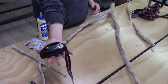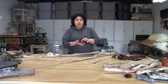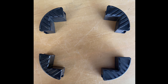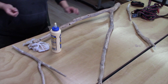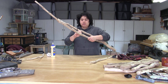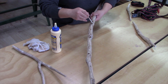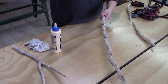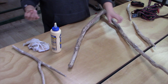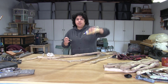These are woodworking strap clamps — I got these at Harbor Freight but you can order them from woodworking stores. They came with these four little corner squares, so if you're doing a frame, follow these up with the brush. This has me looking at end grain on the top and the bottom, so the only thing that's really doing any holding are the two side cheeks, because that's where my face grain — or my side grain in this case — is. So I want to make sure I get enough glue coverage on the two side cheeks.